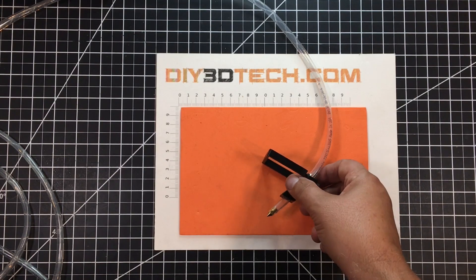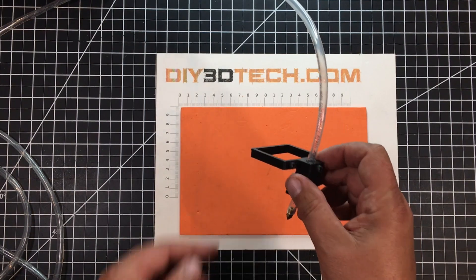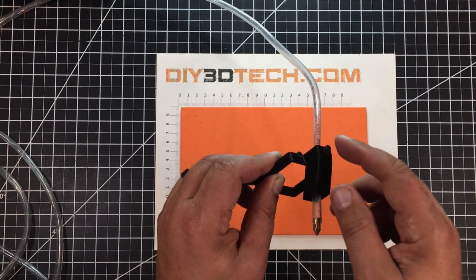This fits most common diode lasers. This is 40 by 40 millimeters, slips across the bottom. What I did is I modeled in some threaded holes for a couple of short M3s, as well as placed an M3 here on the hose control.